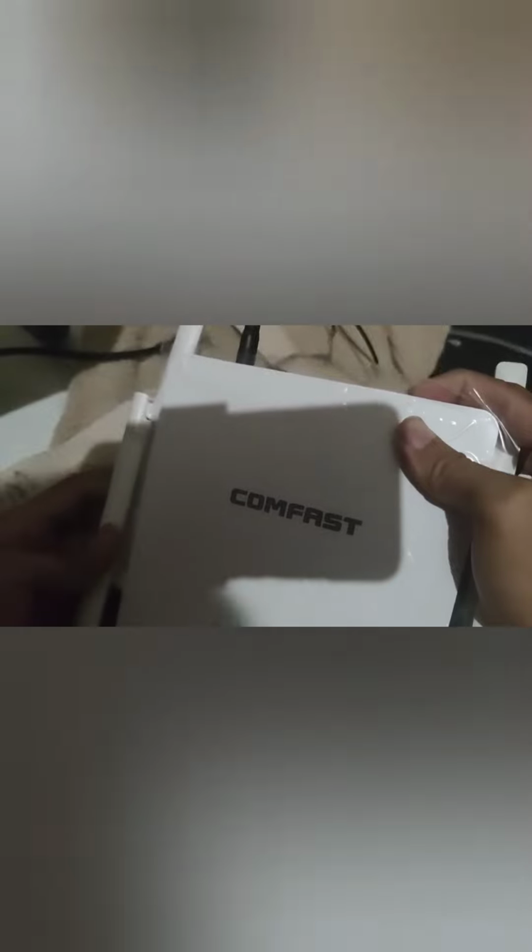Okay, just download it. Now, to go to the bootloader, you have to push the reset button and then plug this in. Just push this, and there you go. Just hold it. See, I'm holding. Wait for it. Yeah, the mini blink, you can let go now. So what it does is it's getting you into bootloader mode.